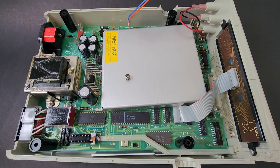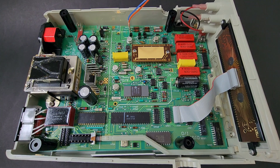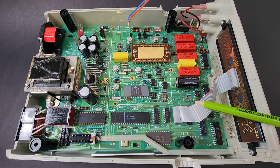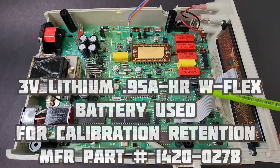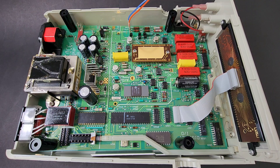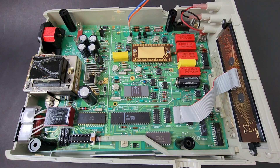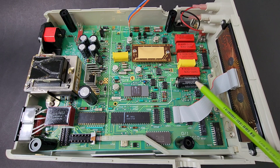Here we are underneath this gorgeous made-in-USA board. We have a big piece of shielding, and removing it reveals the analog side of the board. The first thing you might notice is this battery — it's a 3-volt lithium battery, a hybrid used to maintain the calibration data in memory. We also have a bunch of small signal relays. The analog-to-digital conversion is all custom HP in a pretty intense-looking package. This meter has a history of losing all calibration data when the battery fails. I did pick up a replacement battery and I'm debating whether to change it — we're still at well over 3 volts on the current battery, but it's a case of better safe than sorry.